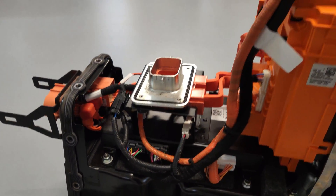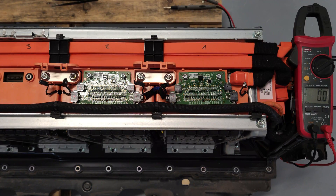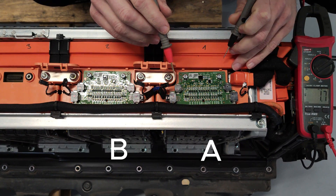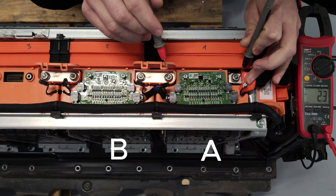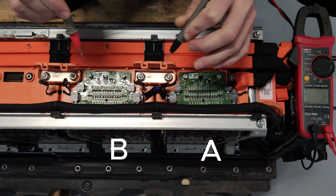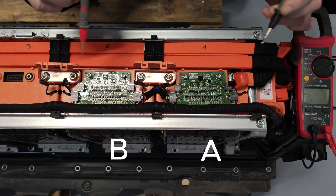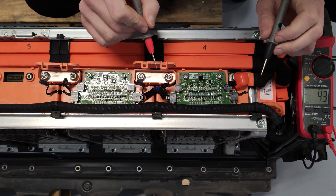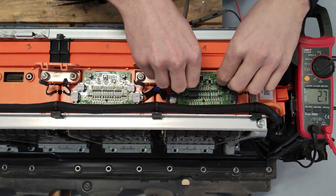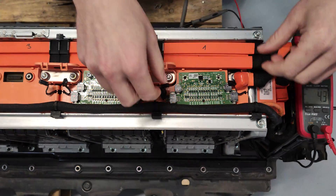Let's take a look at the basic measurement. By measuring the output voltage, we may not detect the problem — as you can see, the voltage of module A and module B are almost the same, and we know module B is defective. So how to find out? The first simpler option is to measure the voltages of the individual cells inside the module. The second option is to measure cell voltages under load, which will almost immediately reveal the problem.